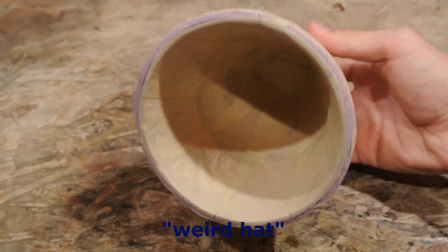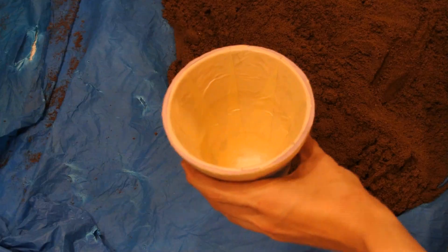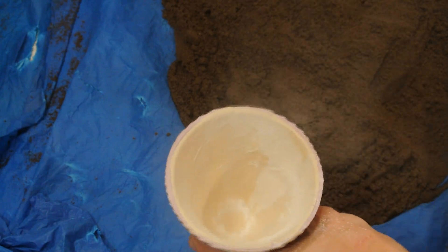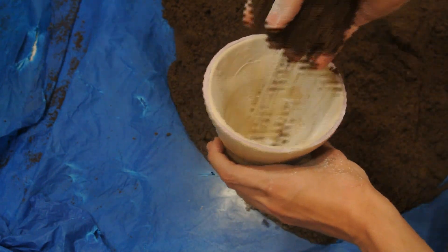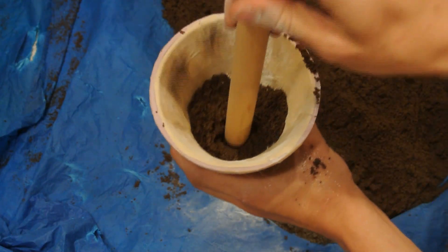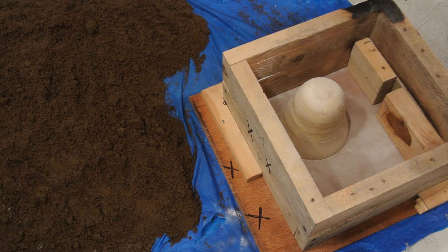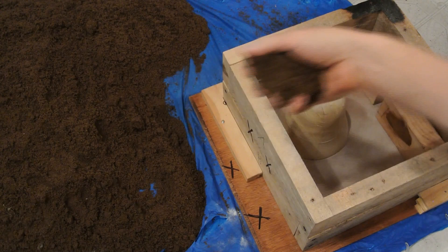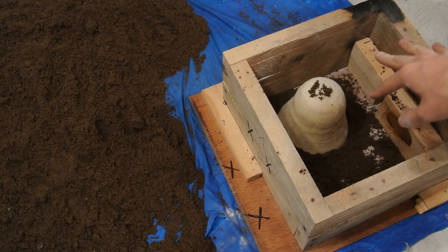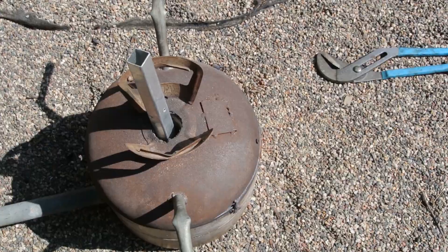I took the finished bell and began to fill it with sand, first using a talcum powder sock to dust things and provide non-stick action. This clay-sand mixture is my green sand — just powdered cat litter clay mixed with sand and enough water to make it stick into a ball when you crunch it in your fist, but not super sticky. I overturned the bell once it was filled, put it in the casting flask, filled that flask with more sand, and cut a sprue to complete the flask.